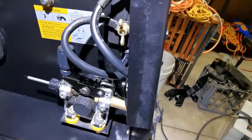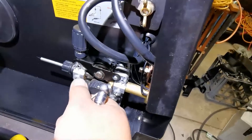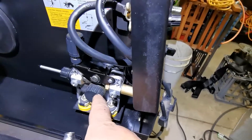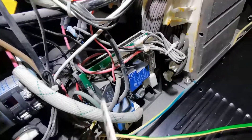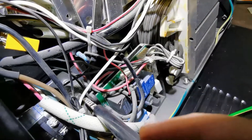So if you've got a problem where you're pulling the trigger and you've got no wire coming through, even though the wire is running through here and you've played around with the pressure, you want to have a look and see if the wheel is spinning. If it isn't spinning, then your motor for the wire feed is probably not working. The motor is located here — this here is the 24 volt motor, basically on the back of that wheel.